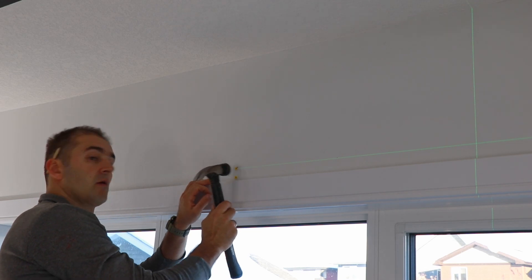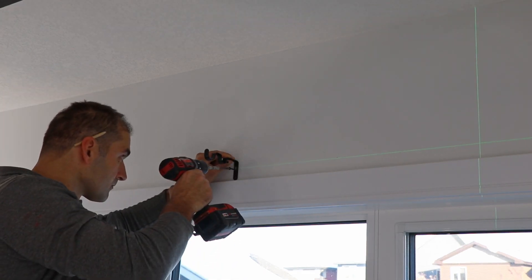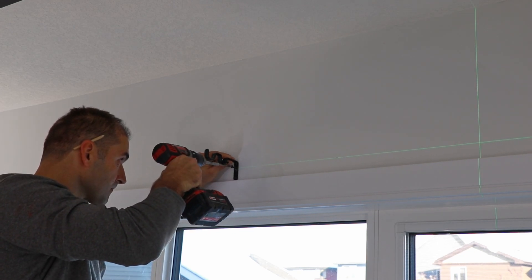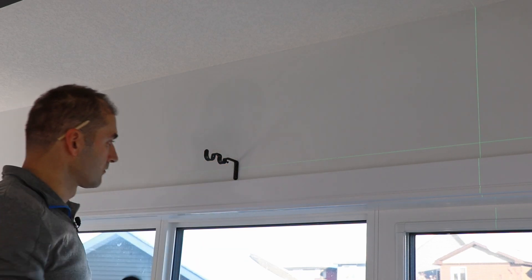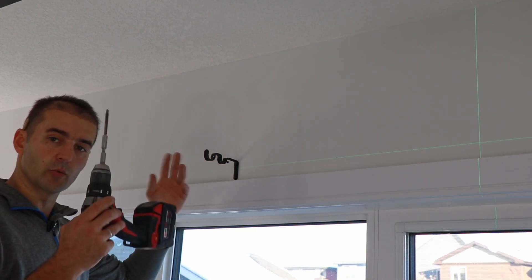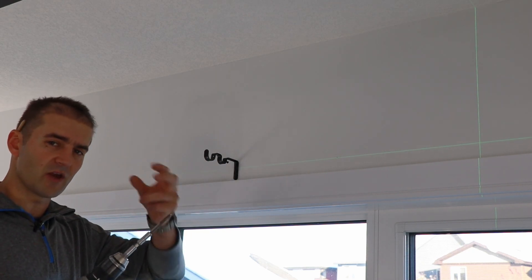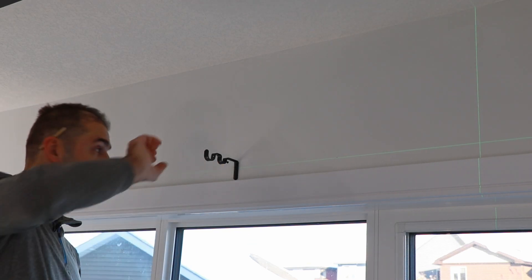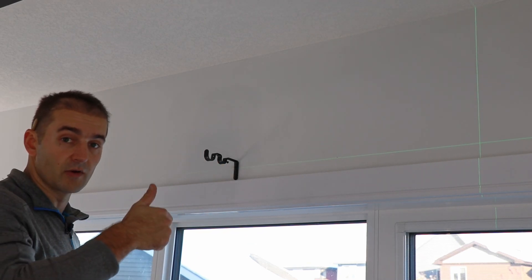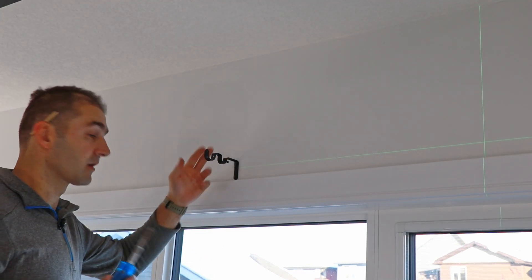Put the anchor in and hit it with a hammer. When using a drywall anchor with a drill, try not to over-tighten the screws — you might kill the anchor, make it spin inside the drywall, and it'll become loose. For that final touch, use a hand screwdriver just to make sure it's tight but not over-tight.